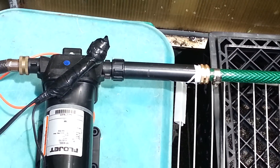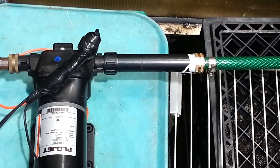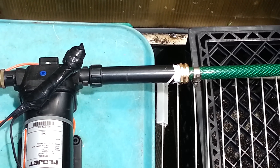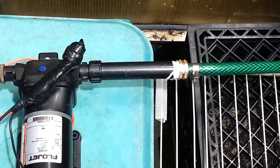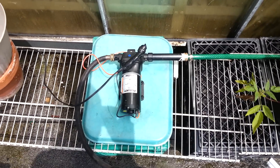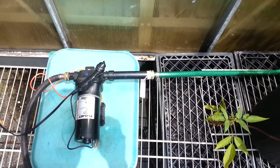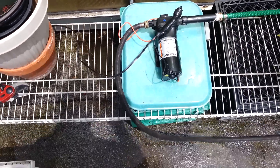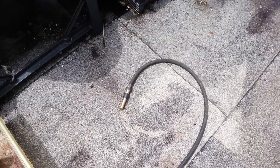As you can see, I've got a water filter attached to the hose, and that's real important when you have a rain barrel because you have all kinds of sediment and so forth coming out of the rain barrel. You want to filter that out before it goes into the pump so the pump will operate nice and efficiently. This is the inlet of the pump with the water filter.